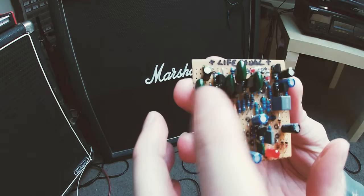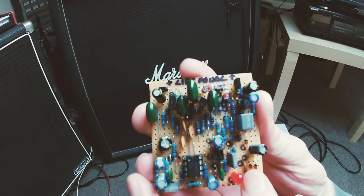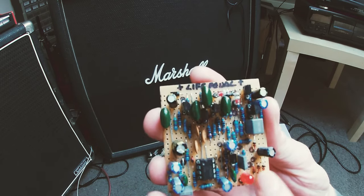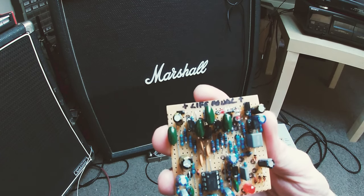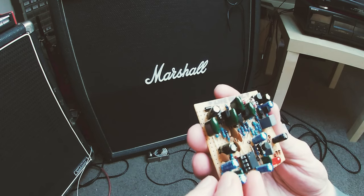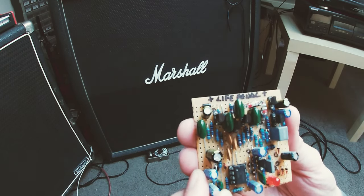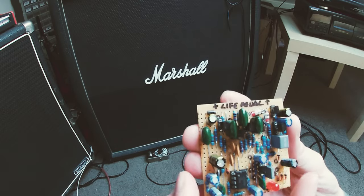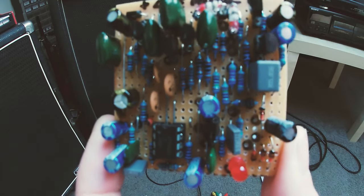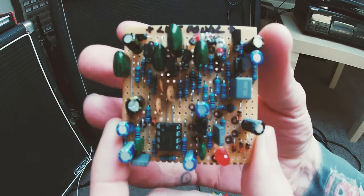They're around here. And then diodes, we've just used the 4148s for clipping. That's for the asymmetric clipping and the other diode clipping option. What else have we got? Yeah, just normal capacitors. I didn't use tantalum capacitors, which are used in the rat pedal. I just didn't have any, and to be honest, I don't think you're going to notice much of a difference in that, really.